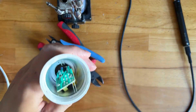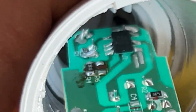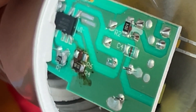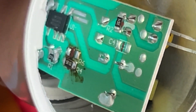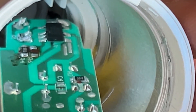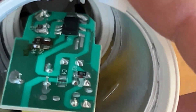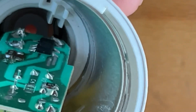I think I did a decent job — we now have a 5.1 ohm resistor in there. I'm hoping R6 and R4 are in parallel. I'm also hoping I didn't bridge the two pads here, because if I did it might blow up — could blow up this track. Let's see.